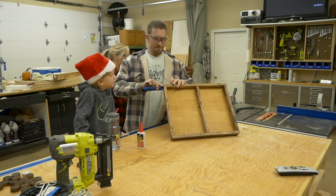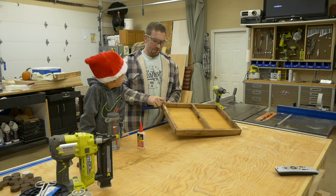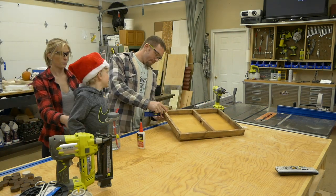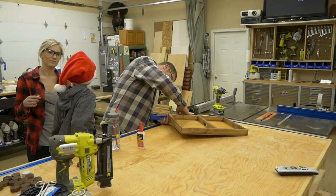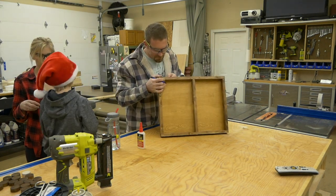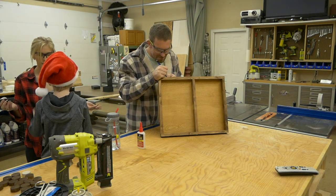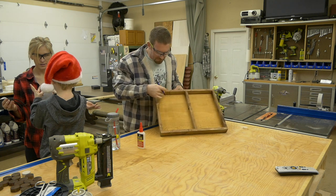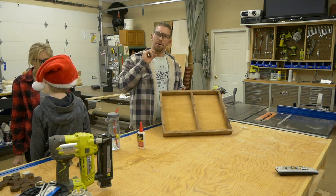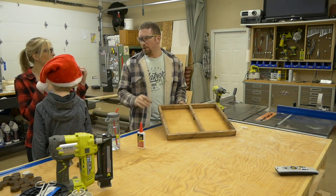We said like a quarter inch? 2 inches, 2 inches from the inside. So that's 2 3/4 inches from the back. And then I'm going to come one, two, quarter of an inch, three, off the bottom of the board. Since the pucks are a half inch thick, we want the cord to rest right in between them, right in the middle of it.